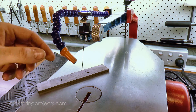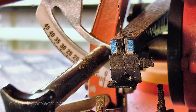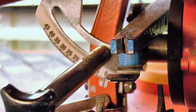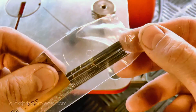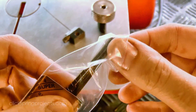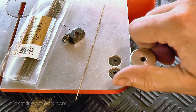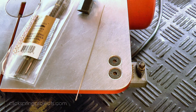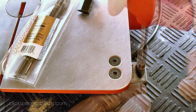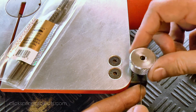Next I started work on the perimeter, and by the looks of the blade, I put the scroll saw away fully tensioned and the blade has popped as it's cooled down. But it's given me a good excuse to give you a closer look at the blades I use on this machine. They're an excellent all-purpose metal cutting blade for this saw, and are particularly effective at cutting brass. They can easily cut through 5mm brass sheet without issue, and only really start to struggle as the stock approaches a thickness of about 10mm. The frames for the skeleton clock were just under 10mm when paired together to be cut out, and that was slow going — but the scroll saw with these blades was still much more effective than doing it by hand with a jeweler saw or chain drilling.